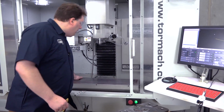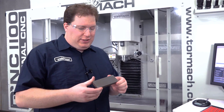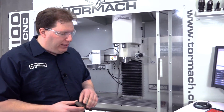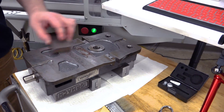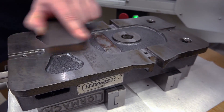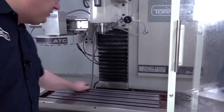Make sure it's nice and clean and also dry. Once you've made sure it's clean, it's also always good practice to use a honing stone. You can often get these from a local sharpening stone distributor. The whole point is to take off any raised burrs from, say, dropping a tool or dropping the vise. It's always good to hone the full surface, even if you're just putting it in one spot. You want to do it both to the table and to the vise.